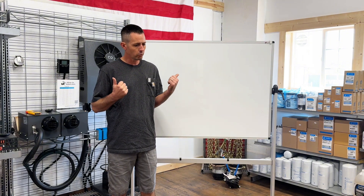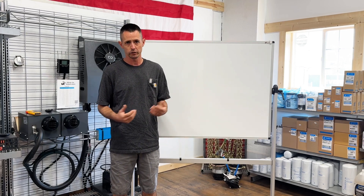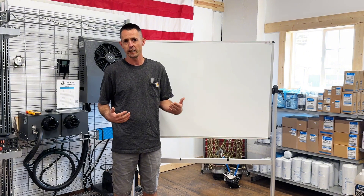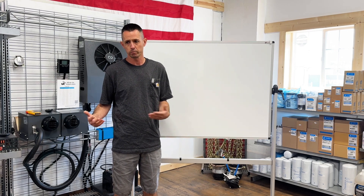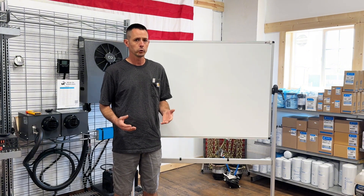We see a lot of times these days standard lead acid batteries — your regular 925 CCA batteries — they don't last. Years ago you used to get three years out of a set of batteries, but now you're lucky to get 18 months. There's a lot of guys that come in at 12 months with a 12-month-old set of standard lead acid batteries and they're shot, just because we're running so many cycles through them — and that's not what they're intended to do.